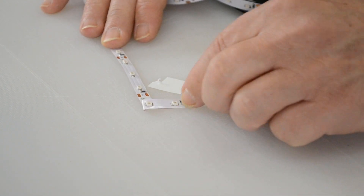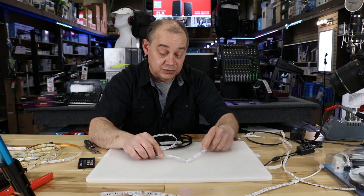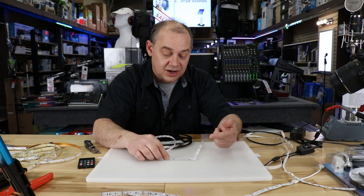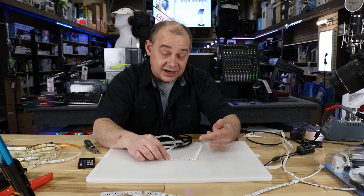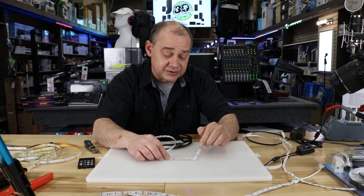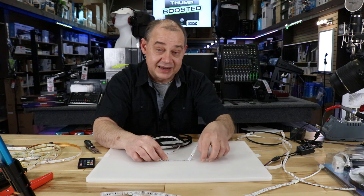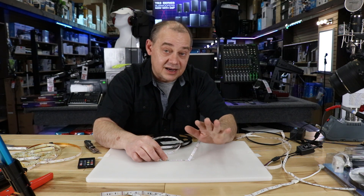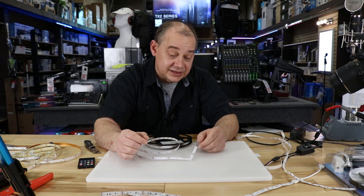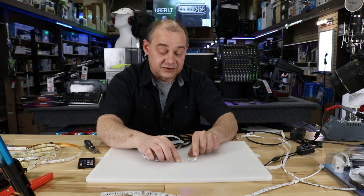You can push down, but the more you push down, the more chances you take of something getting damaged. Good foam tape at the back — not just the regular backer on these things. Foam tape is going to be a big conversation on this channel. Foam tape is for everything except what this was originally made for, which is aluminum tracks, acrylic surfaces, and glass — any smooth, perfectly polished finish. It's only double-sided sticky tape, not foam tape. Foam tape gives you the texture difference to bite into MDF, OSB, wood, or any painted surface. You normally silicone the tips down too — it's a really nice job.